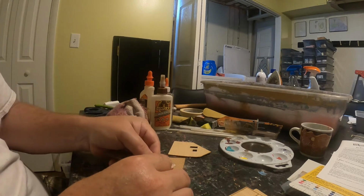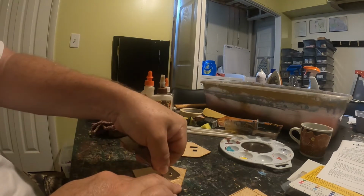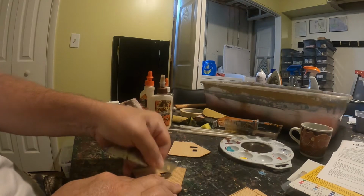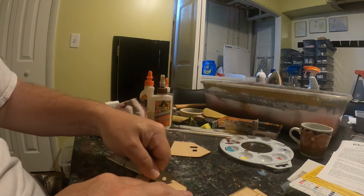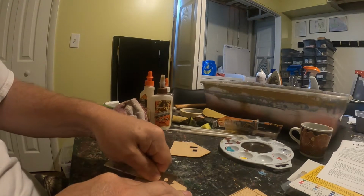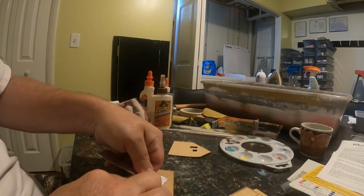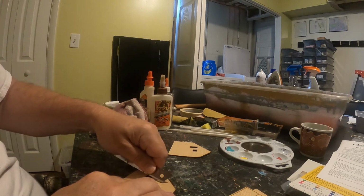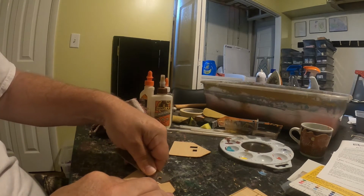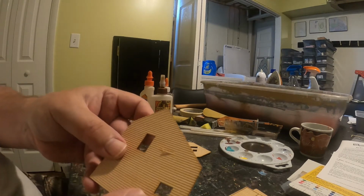Then after you do that, you're basically cutting a little indentation mark vertically. And then you just kind of go up under the wood a little. And it takes practice. It's not that hard. And you're going to simply lift that piece of clapboard a little bit. So I'm going to show you an example of that.